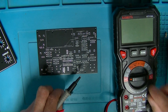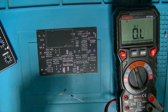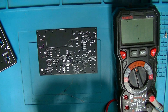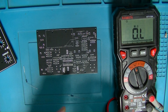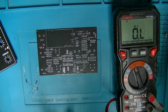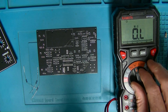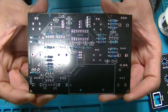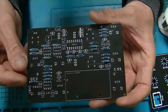As usual, I like to check all the resistors before I put them in, just to double check and make sure the values are right. First up are some 10k. If you check them now, you don't have to check them later and troubleshoot if there's some issue — that's just a smart way of working. Alright, so that's our resistors done. Pretty painless, easy enough to do.